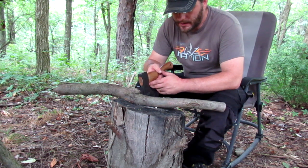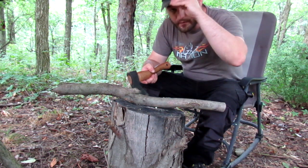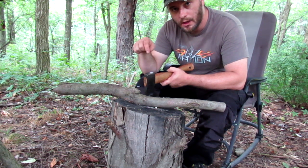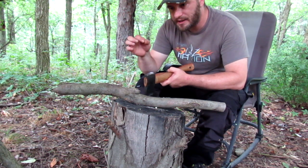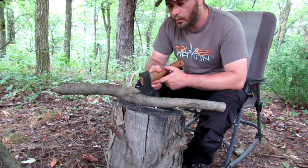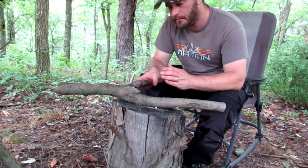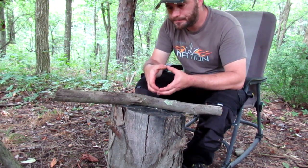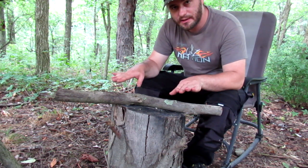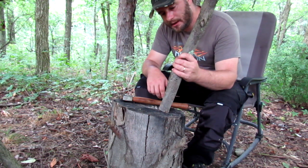So what we tend to do is make what's called a pilot stick. I never really hear anybody talk about this, but it makes things easier. If you're doing woodworking or even metal work, before we drill a big hole, a lot of times we drill a smaller hole just to get that bit set — it allows the bit to come through without biting too much, without ripping things apart, and without getting jammed. Well, when I'm driving posts or stakes in the ground, I like to make a pilot as well. So if I'm using a three to four inch log with a point, I'm driving that into the ground and there's gonna be a lot of resistance, so I'll make a smaller stick called a pilot stick to start the hole.